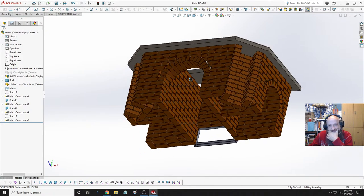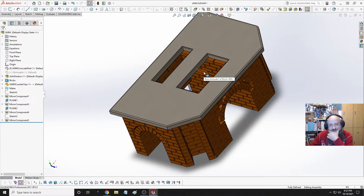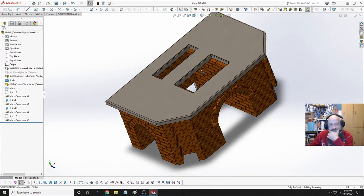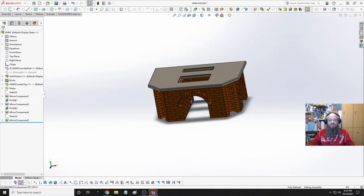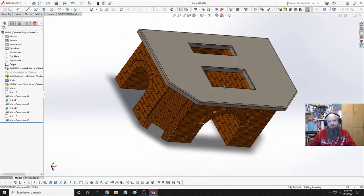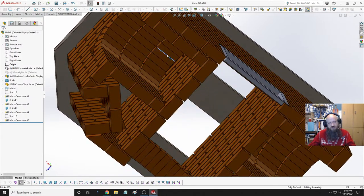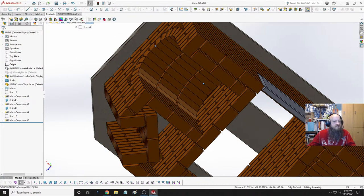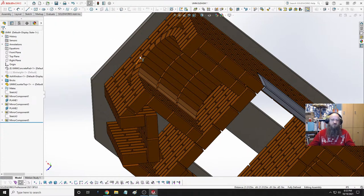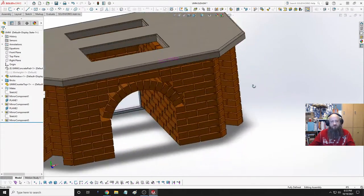I almost wonder if putting in supports going left or right underneath the center of this would be prudent. Like start it a couple bricks up, but it ties into this wall, that way it's integrated. Oh, but if I move that wall, then that shortens the distance. Let's see, what would that be? Select midpoint, and here. What is that distance? Yeah, it'd be like 20-inch logs. I guess that's not too bad, versus I think I was getting close to 24. That'd be fine.